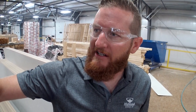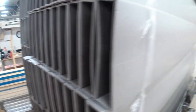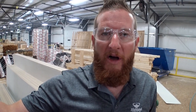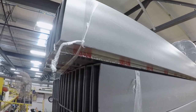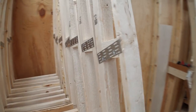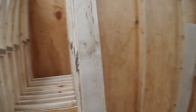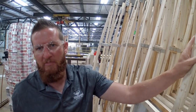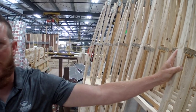This is the AC ducting - it's a foam duct. A lot of competitors use just a foil duct, which gets condensation and possibly wet spots on your ceiling. Part of what makes this a magnum roof system is we put nail plates on both sides of the trusses. Many competitors just put it on one side, which could twist over time and separate - we put it on both sides so you get double the strength.